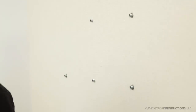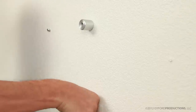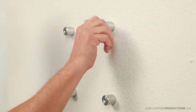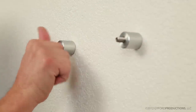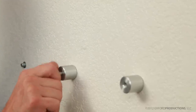Now with all your studs in place, you can thread on your first layer of barrels. Snug them down by hand. Here we are using the shorter one inch by one inch barrel for the first layer. Now you will screw in all of your threaded studs to your first layer of barrels, or you can thread the stud into your cap, then through the material and into the barrel. This may be the preferred method in some cases.